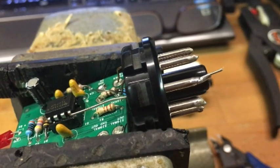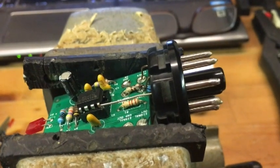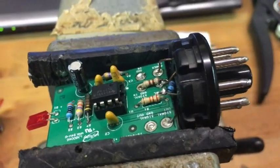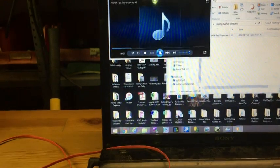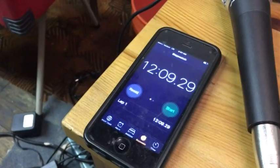Now there's the wire going through the pin - a regular 22-gauge wire through the pin and soldered at the end with some sticking out. I trim off the piece that's sticking out, being careful not to cut up into that pin too far, and then I wrap the resistor wire around the 22-gauge wire, and then I solder it, and then I clip off the excess. It's plugged in. Lights come on. No smoke. Pass a signal. No noise. So we fixed three of them and we're at 12 minutes.